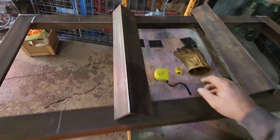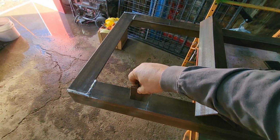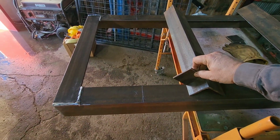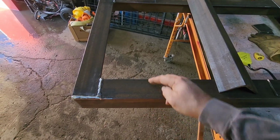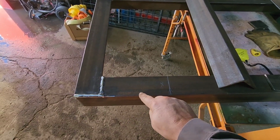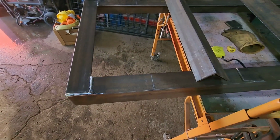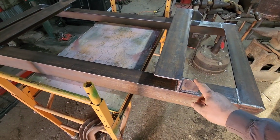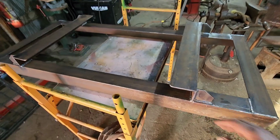And then these pieces here, we're going to turn these into gussets. We'll put these here on the outside like this to gusset that. And we're going to run our gussets out here towards the outside of the frame because this is the strongest portion. If we put it in here, it's a little more chance of it bending. So we'll set it back just far enough to get a nice weld in here. And then we'll weld obviously both sides of that angle. Got our pieces on, got them all gusseted up. We 45'd the corner of our gusset here, and we've rounded the corners of our channels.